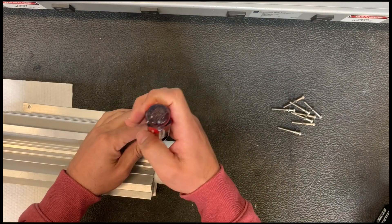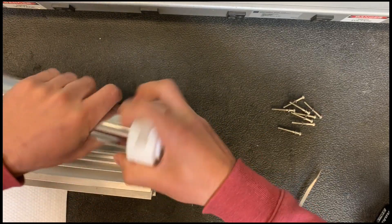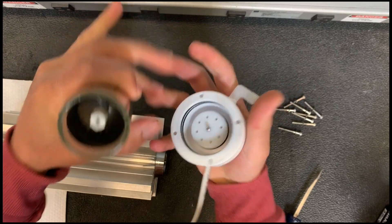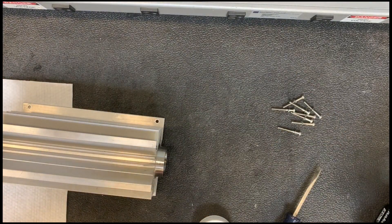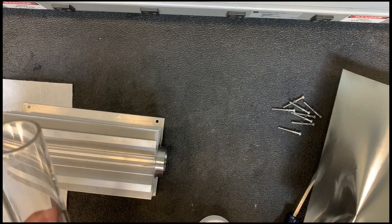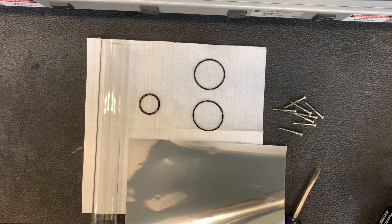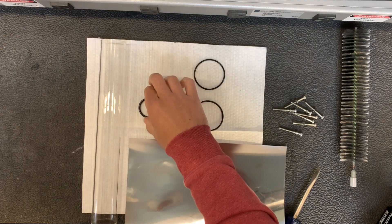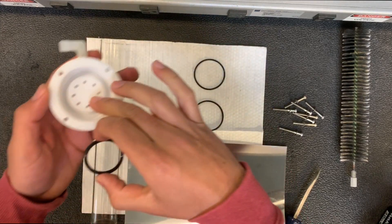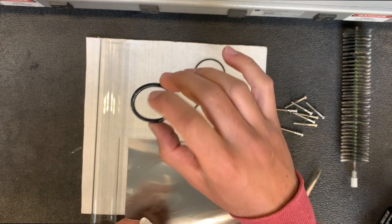Go ahead and twist the brush out of the screw — push your brush out. The shim is the same, but the glass is different. The brush is the same, the outer o-rings are the same. The only thing that changes on the vacuum versus the pressure is that on the pressure unit you have two smaller o-rings that go in the center of the end cap. This vacuum unit only requires one, which is ORG-10 — it only takes one per end cap.